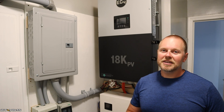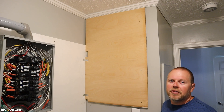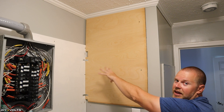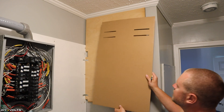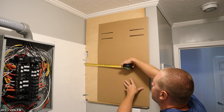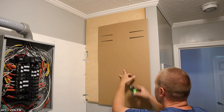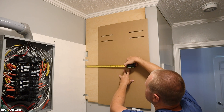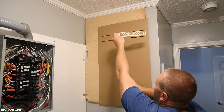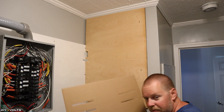First thing is to install the bracket to support this heavy inverter on my wall. In order to mount the inverter, I have a piece of three-quarter inch plywood on the wall. It only had one stud, so I've used some brackets on the edge to get this attached. This piece of cardboard is a template that comes with the inverter, and I need to make sure I have seven inches of clearance on both the top and the side for proper ventilation. I'm going to bring this down to about right there, use a level, level out the top of the cardboard, place a couple of marks where the bolts need to be inserted, and then get this on the wall.